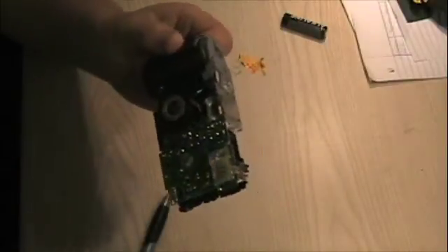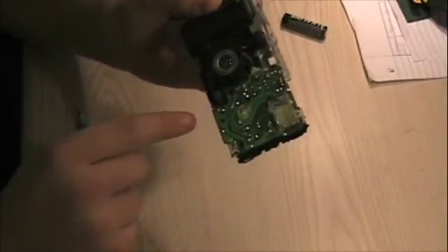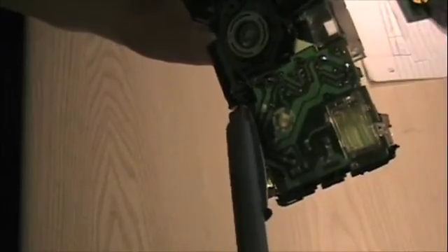There we go. Now the capacitor is discharged. But just to be safe, I also discharge across the capacitor leads, as there could still be some high voltage in there. Now you can see them more closely. Oh, there was some charge — thank goodness I checked that.